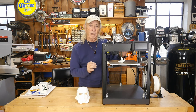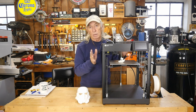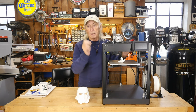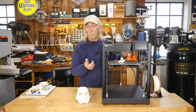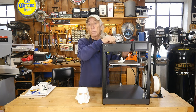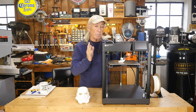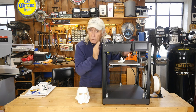With other machines you have to be systematic getting the filament out. The SK-1 does a marvelous job of unloading. It takes a little longer than some other machines, but those other machines jammed - I'd have to take the extruder apart, mess with the filament, or in one case use pliers to do almost a cold pull. With this machine you just plug it in and use it. It's built to be used - when it came in the door everything worked the way it's supposed to.